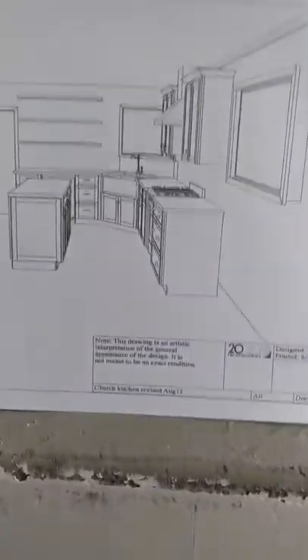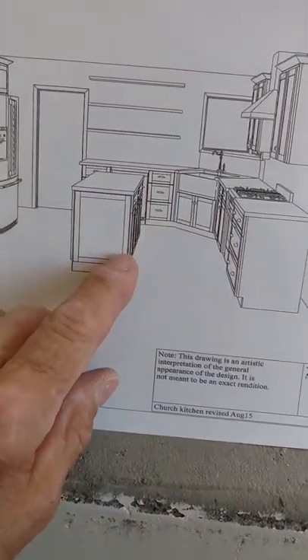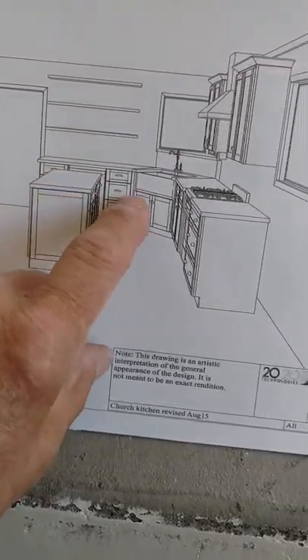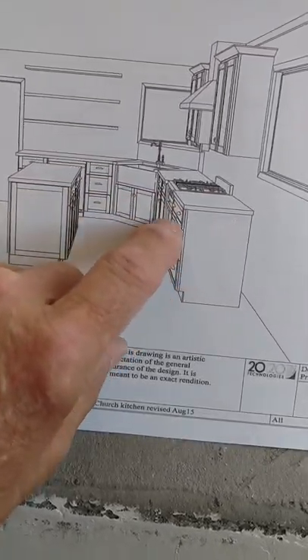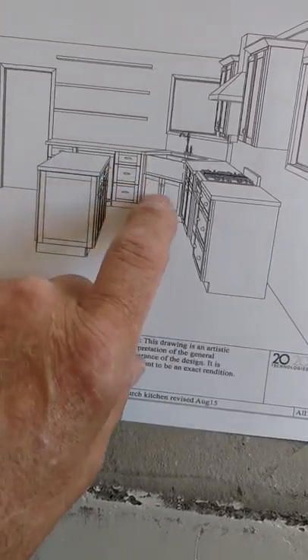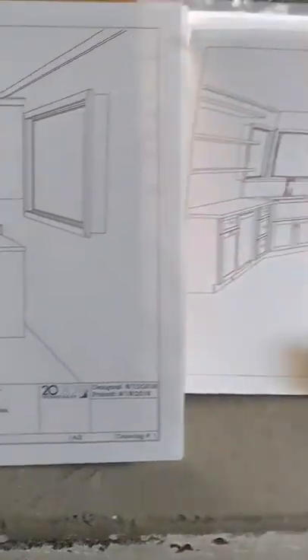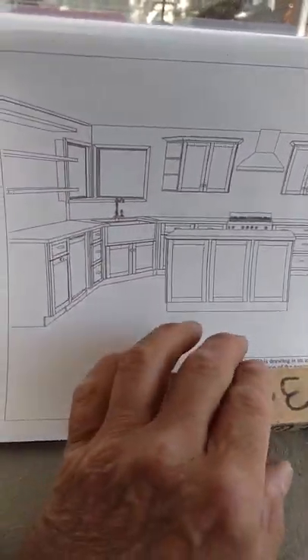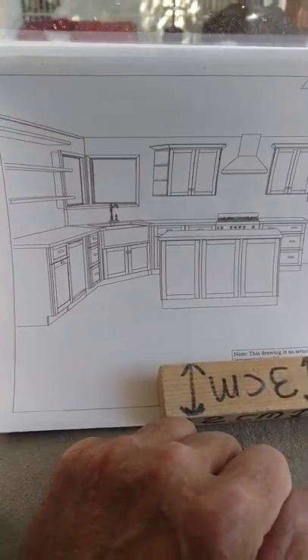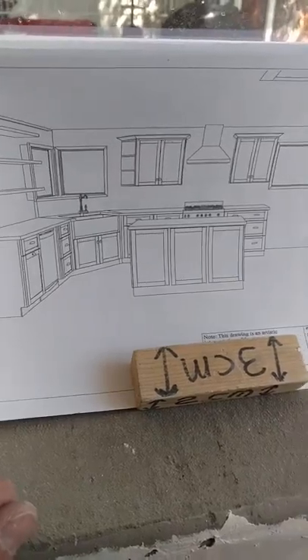There's our space, our cabinets. Here's our plans. These are pretty typical home center modular cabinets — 3-inch increments is what they usually come in. I'm going to show you how to determine all these points to measure from to get your fillers and your cabinet measurements right. You should really do these layouts before you buy your cabinets so that you make sure all the cabinets are correct.